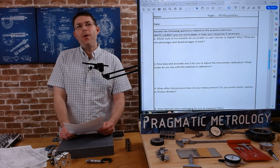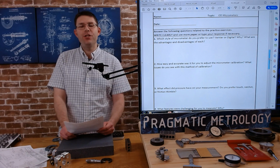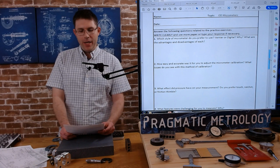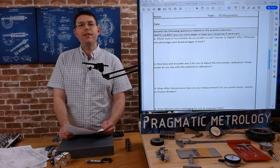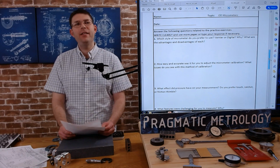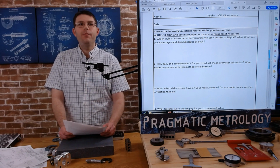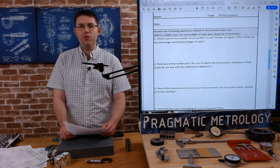Almost everybody I talk to about this question tells me they like the digital because the digital is easier to read. There's no Vernier math involved. And my response to that is that's not a good enough answer for this question. I understand that you want to use what you're comfortable with, and I totally get that. I don't want to use things I'm not comfortable with. But you want to get comfortable with the Vernier scale. It's a necessity if you're going to be in this industry.